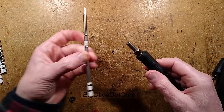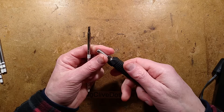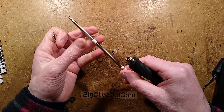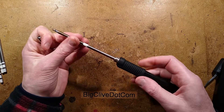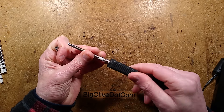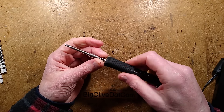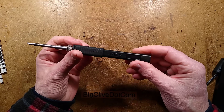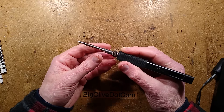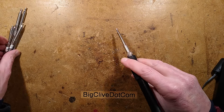This thing is designed to take standard T12 bits — these are only about three pounds or three dollars each, they're cheap, which makes it a very useful little soldering iron. You unscrew the end and plug your soldering bit in. I recommend giving it a twist just because it has weaknesses, as you shall see. I've got a C4 bit — a 4mm chisel bit — in it. You could use many other bits.